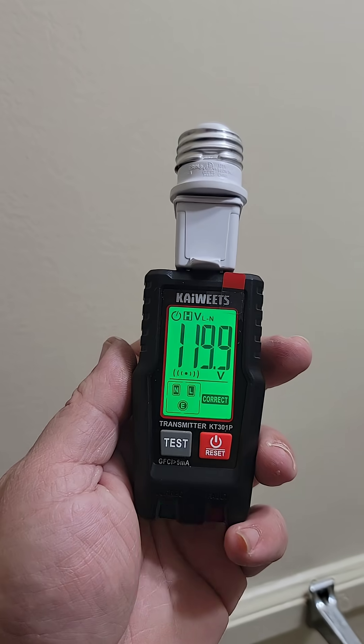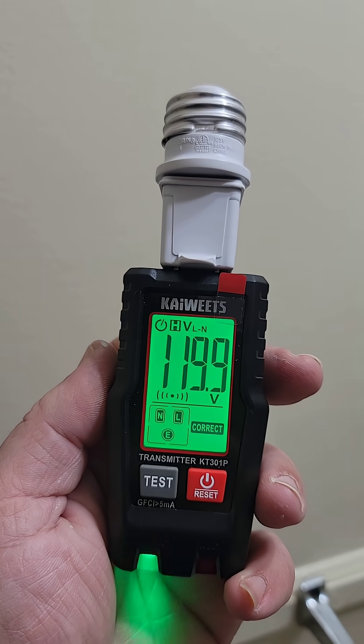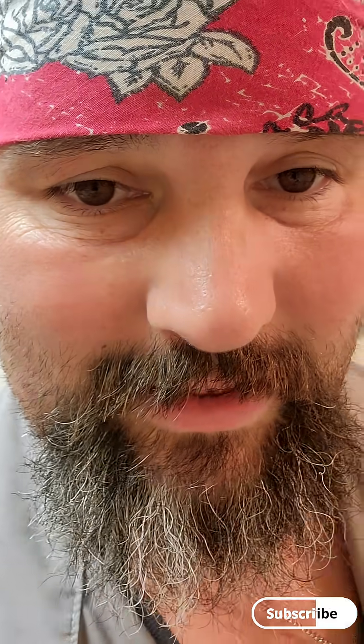We've got a clear winner, so this is functioning the way it's supposed to. We fixed the faulty light switch, hooked up a new light fixture, corrected the ground wiring, and were able to properly locate, identify, and label the breakers for the next technician. Every situation I've used this tool, it has helped greatly — repairs go faster because you can easily diagnose a problem or locate a breaker without any second guessing. Of course there are going to be certain hiccups along the way, and when you run into one of those you just have to dive deeper and figure out what's going on.